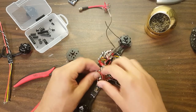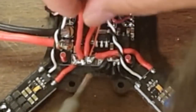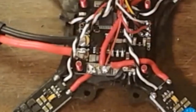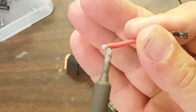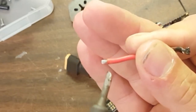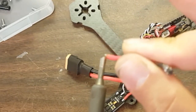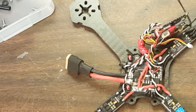This is going to be a little tricky to desolder just this one without getting the others. What I do when desoldering is I try to apply heat relatively high up on the wire — not close to the base, but close to the insulation. That hopefully flows down and preferentially melts the solder on this wire and not the solder on the rest of the joint. As I do it, I apply a little bit of pressure to peel it away from the joint as the solder flows, which helps me get just this one wire off and not any of the others.